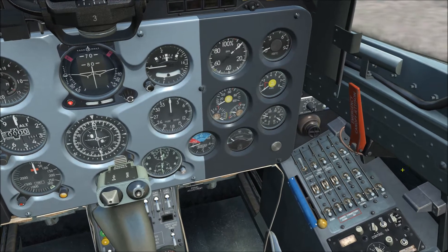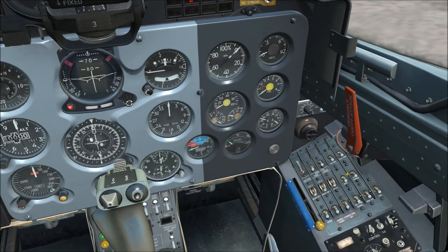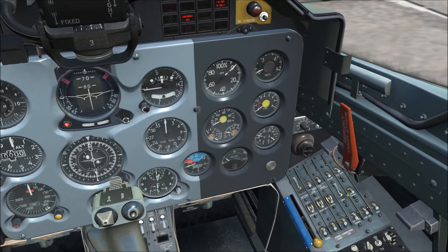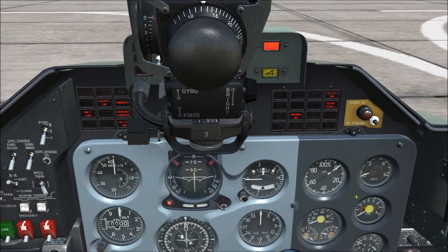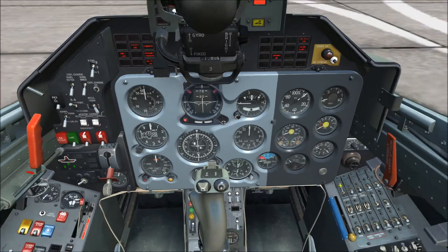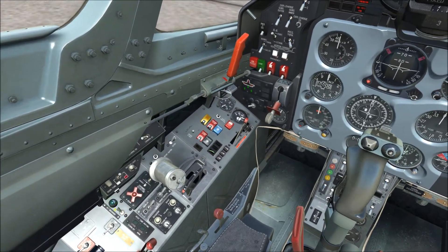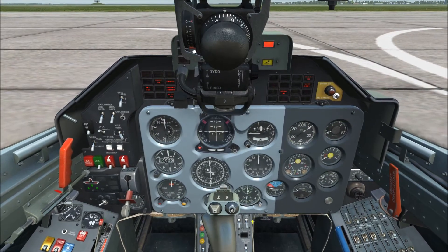Let's do battery forward to on. All of these switches will be going forward to the on position. Next, RDO — which controls the radio — it takes one to two minutes to warm up, so I like to get that started early. Then go ahead and turn on the flight recorder, which is switched left to the on position. This light will occasionally blink to indicate it's working.